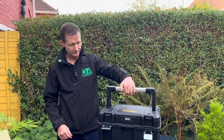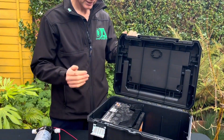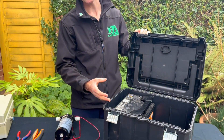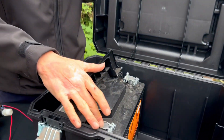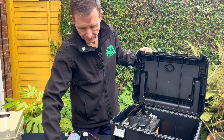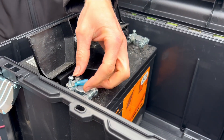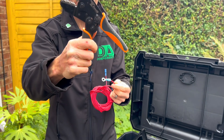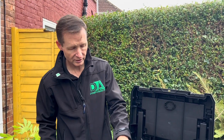So I've got all my parts that I'm going to use inside this pump box. What you'll see here is a 12-volt leisure battery — it's 70 ampere-hours. I think if this pump box is only going to get used every now and then, that's going to be more than ample. I do recommend 85 ampere-hours if you're using it in everyday use. I always recommend battery terminals — it's a personal choice and I think it's a good all-rounder. With battery terminals you need to use ring connectors, and to get the ring connector onto the cable you use a ratchet crimping tool. Those are all colour coded and you can get them from Alfreds — I did a video on that.